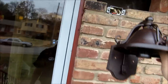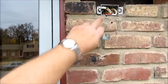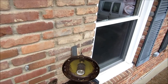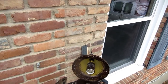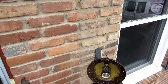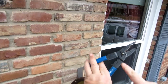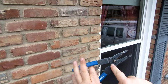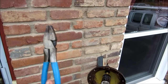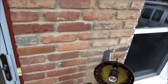With this particular fixture, the bolt pattern is not going to line up with the ears. So what I had to do was go out and get one of these adapter pieces for lamps. It comes with these bolts - I actually took my side cutters and cut them off. A lot of people will use wire strippers and utilize the 8-32nds, 10-32nds and cut their screws off, but I find lineman's pliers are a lot easier and that's just the way I've been doing it.